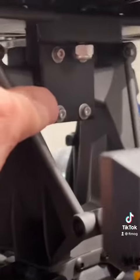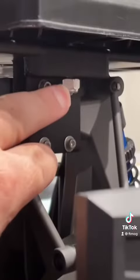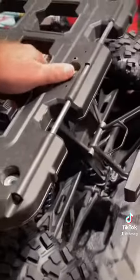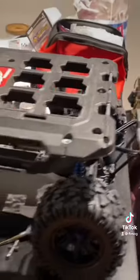We got both sides on here. These are metric M3s because I use metric for just about everything I can, but this ended up being a quarter-20 half-inch because that's what I can get locally. We run that through the top of this mounting plate at different spots, and now we've got a fixed hard connection for that pack-out.